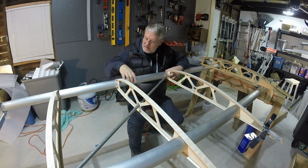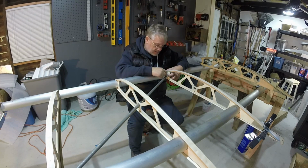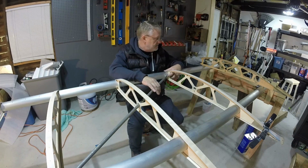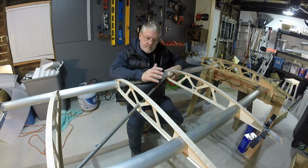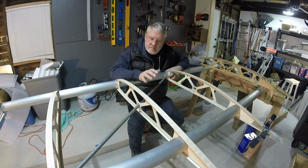Of course, all my spars have been rotated, so they're perfectly upright. Ribs will be positioned and clamped, and I will start drill, deburr, cleco. All of these will be in position, so that will be kind of a cool project. Lots of holes to drill. Hopefully, no extras. I'm gonna end this episode right here. It's plenty, I think.